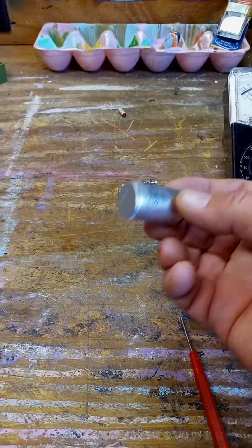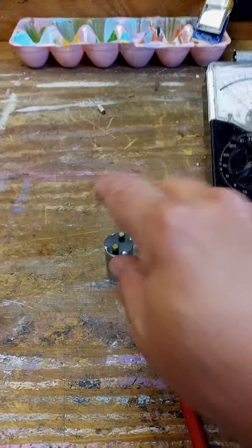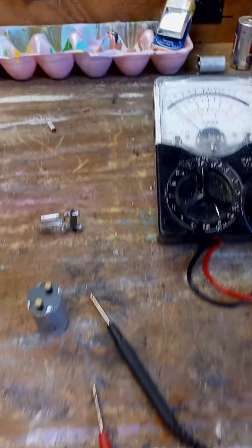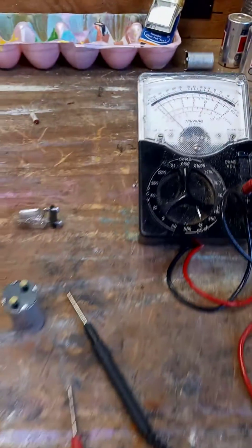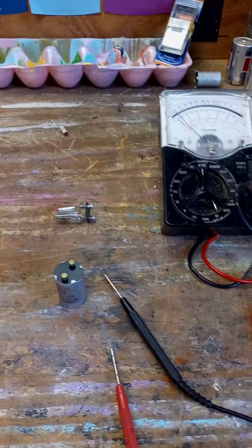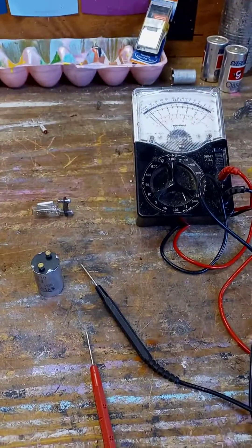So that's a good way to check them. For you vintage light collectors out there — fluorescent lights and all — if you want to keep these old starters working, you can certainly do that. But you should never have a reading across there of any kind of current going through that starter. If it is, it is definitely bad. And like I said, 90% to 95% of the time, it's that condenser that shorts. Thanks for watching — just wanted to touch base on that while it happened.